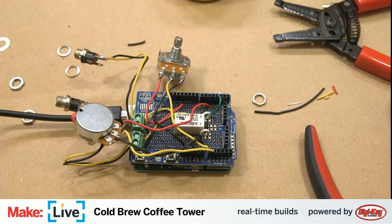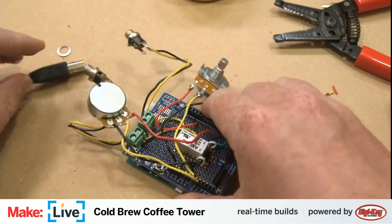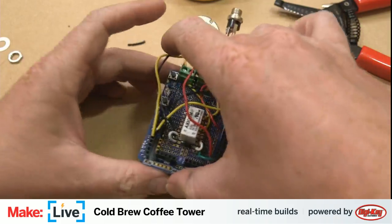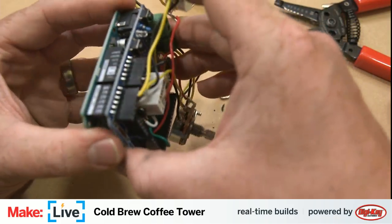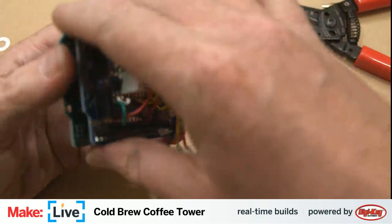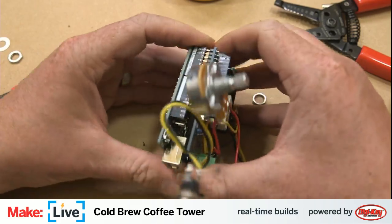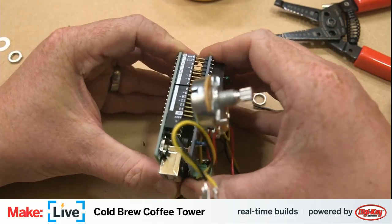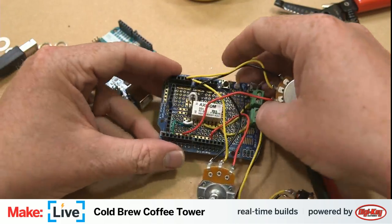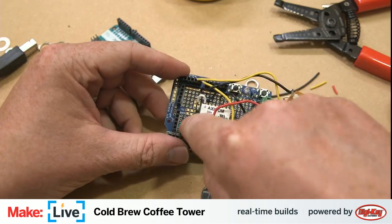Okay, so the very first thing I'm going to do is desolder this diode and just take it out of the loop. So I feel good about the rest of my soldering on the relay. That's exactly how I had it earlier when I was testing this on a breadboard. And if that looks good, then the next thing we can do is maybe try to reverse the polarity of the diode. So that's the guy we gotta remove.